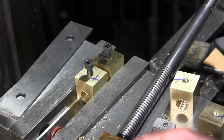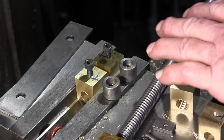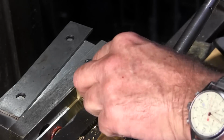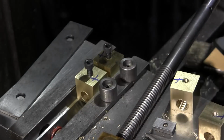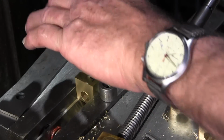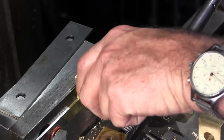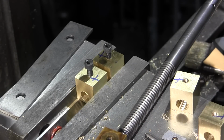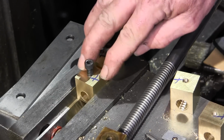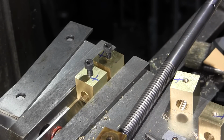And the main importance is because these two mounts inside the carriage have got to start out centered or square. These have play to adjust back and forth so that these blocks can be wedged apart with the wedge there. And we're going to go ahead and drill through and put set screws to spread them. But we need to have this Acme thread go through them and be timed between the two blocks at the initial installation of the block.